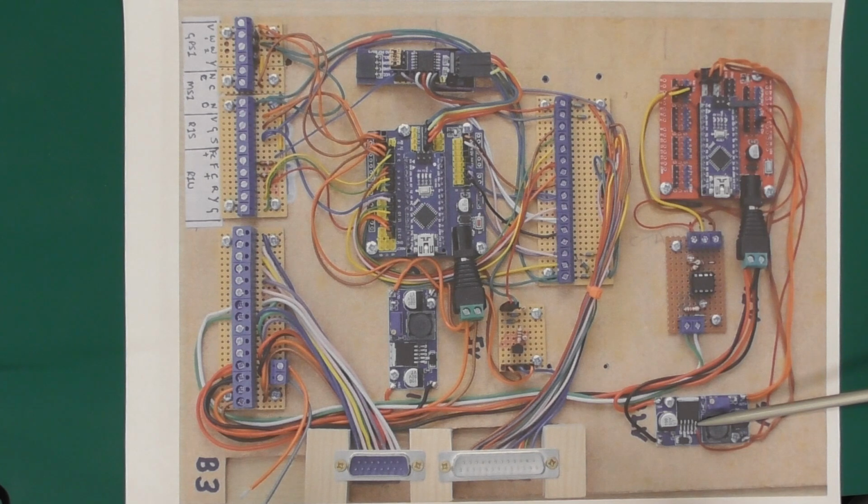I've broken a pin which was grounded on this board, because if you look up that device, the buck converter controller, you'll find that this pin is known as the shutdown pin, or the enable pin, whichever way around you're looking at it. If you ground it, the output is always enabled, but if you pull it high, then nothing comes out of here. So what I've got this arranged as is, when you first power it up, there is no voltage out of here. This pin pulls high. As the power comes up, this pin comes up with it. So no power comes out, so you don't get any nasty twitches on the servos at power up.